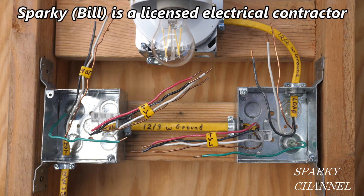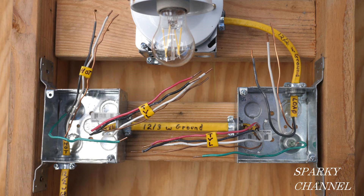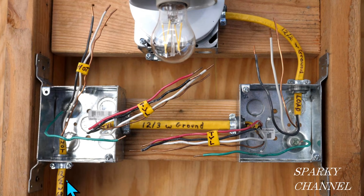Here's my demonstration board for the plans I just showed you. Of course the cables on the actual plan are much longer — these cables are much shorter — but the wiring is going to be exactly the same. Notice we're starting with the four by four metal boxes as called out in the plans. Here we have the hot cable that brings the current into this whole system. This is the one that comes from the main panel — it says 'hot' right here and it's a 12-2 with ground, meaning two conductors: the black hot wire and the white neutral wire, plus a bare ground wire.